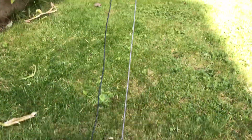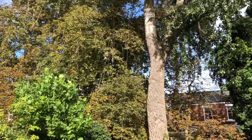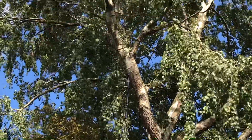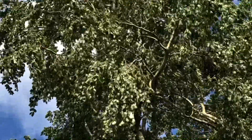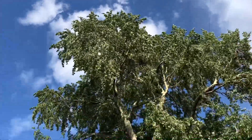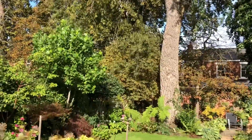And these are the antennas I'm comparing it against. This is the 80 and top band quarter-wave verticals that are attached to a DX Commander base. The 80-meter goes to that tree branch there. Top band you can see — it goes right over the top of the tree, a bit like a walking stick shape down either side. They're feeding off the currently unused DX Commander base with all the radials under lawn.